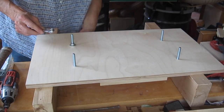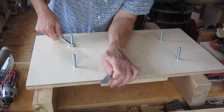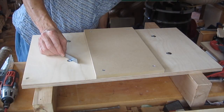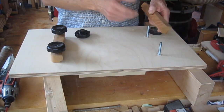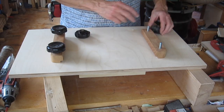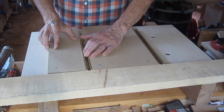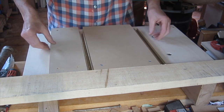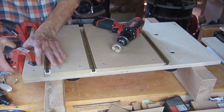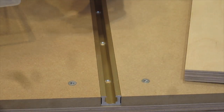I'm feeling underneath with a ruler to see when I've cleared the surface — it hits a limit there, so there it is sunk in. These pieces go on the bottom and they'll grip the iron table of the drill press. Now I can just build out from that center piece, keeping these edges even. Then the T-track can be drilled and screwed in.